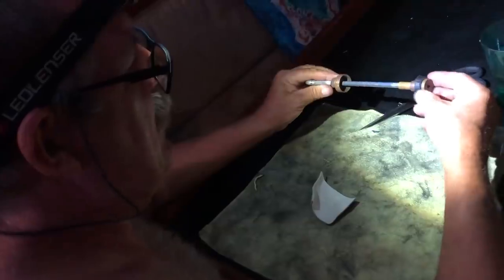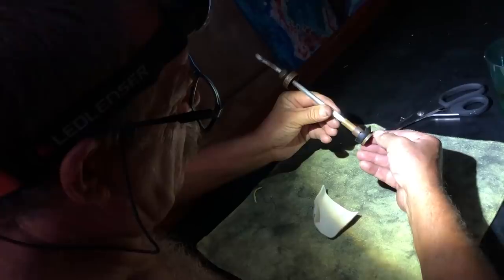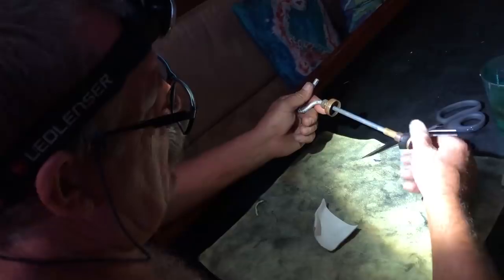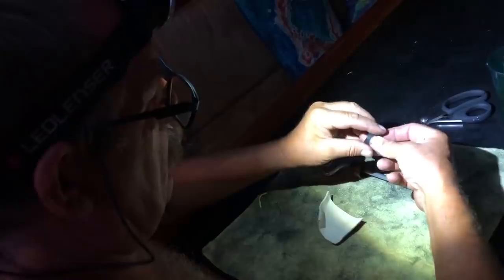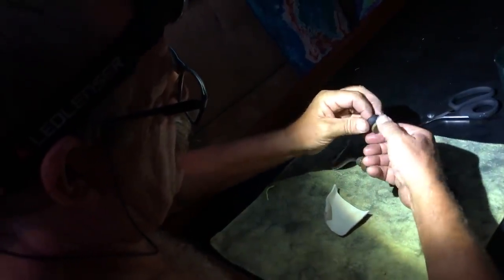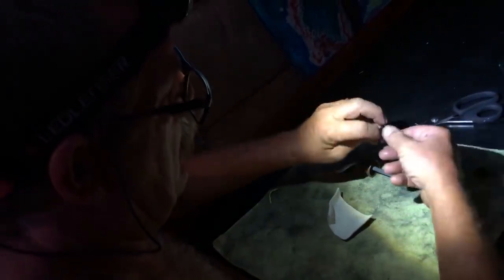What's going on? Well, look at that. She's torn. She's had too much work, this old girl. This is our plunger. It's about 10 o'clock at night, and I felt like doing an oil change because it was due. So I started plungering, and look what I found. The oil wasn't being drained out perfectly, so I found that the bucket on the lift pump had torn.